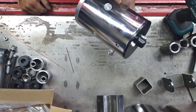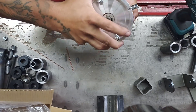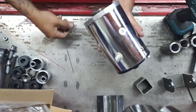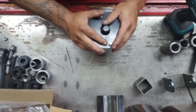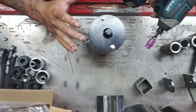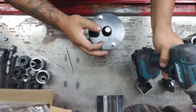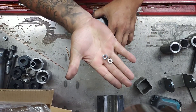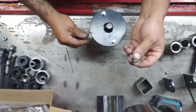This is a standard street motor I just took out of the box. The street version is going to have the black cap; the comp version is going to have the five-spoke chrome cap. When motors come shipped they have little square nuts on them — these are retaining nuts that hold everything in place so it doesn't fall off during shipping. For this video we're going to take those off. They're a 10-millimeter, so I've got that set up on a Makita impact — you can use a hand ratchet if you prefer.